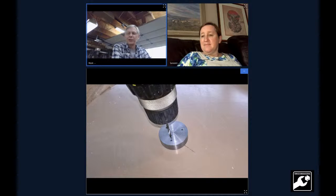Let me explain what a Wimshurst is. A Wimshurst is an electrostatic generator. It was invented in 1880. Originally they were glass disks, but plastic actually works better. Right there I'm drilling a plastic disk for a drive hub. The two disks counter-rotate close to each other, about an eighth of an inch apart.